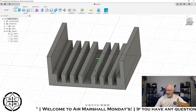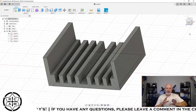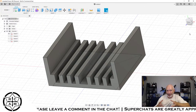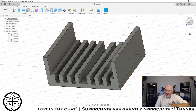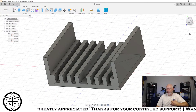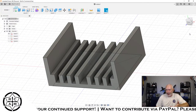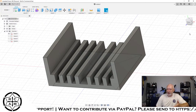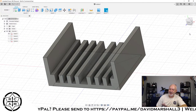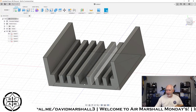And I am pretty happy with this for the VTX mount. Now, when I'm initially designing these, I don't put a lot of effort into making them look pretty. Because this isn't a commercial product, I'm not that concerned about fillets and chamfers and making it look like something that I want to sell. It's far more Spartan and utilitarian in nature. So I just leave it like this, and it's actually a little easier for the printer to not mess with any of that stuff. So this is what I will end up sending to the printer.